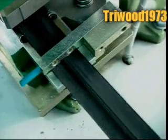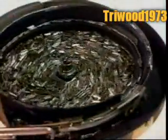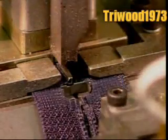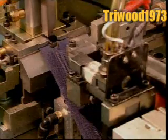The other model is the open end zip, the kind whose two halves do separate at the bottom when opened, which go on jackets, for example. At the bottom end of these zippers, a machine applies a clear reinforcement strip. This stiffens the tape, so that the next machine can apply the pin and box. The pin is the vertical piece of metal on one half of the zipper that has to be aligned in the box on the other half, before you can pull the slider to zip up.